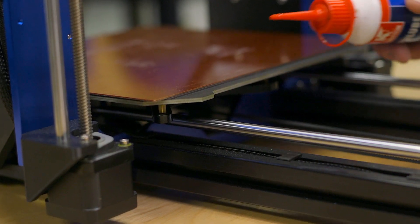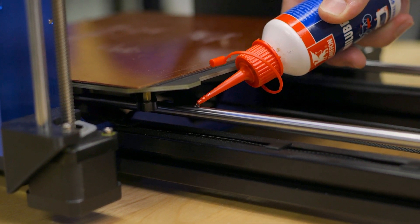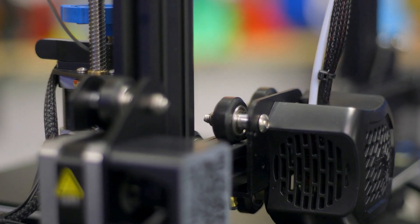A simple way to apply lubricant is to move the printer to all the minimum limits, add lubricant to the rods and screws, then move the printer to the maximum limits and repeat. This should decently lubricate your printer, but in some circumstances you may need to remove the bearing completely to adequately lubricate it. In the case of V-wheel 3D printers, lubrication is not something you need to concern yourself with, as you have plastic wheels riding on aluminum, so the two surfaces should roll smoothly. But you should still replace the wheels if you can feel flat spots or they don't turn smoothly at all.